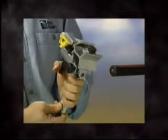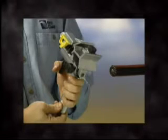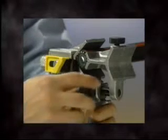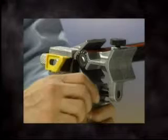For removal of outer jackets from medium voltage cables, the WS64U will be configured with the end stripping blade. Select the jaw position for small or large cable diameter. Depress the spring-loaded trigger and place the tool on the cable. Tighten the jaw locking knob to keep the jaw securely on the cable during stripping operation.